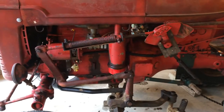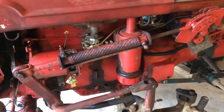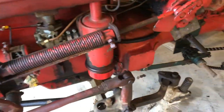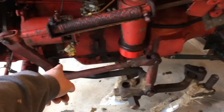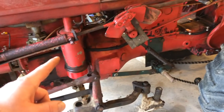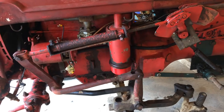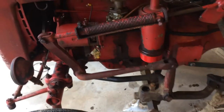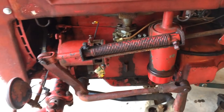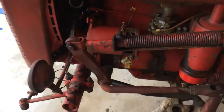If you've run across this video, I would say go check out the Farmall Cub, but on this one I'm essentially doing the same thing. I've already removed the two wires off the generator. I've got some kind of electrical issue going on — I've replaced voltage regulators twice on this thing. I keep diagnosing it as the voltage regulator being bad, but I just cannot believe they keep frying. I'm talking two of them in the last year, so I'm going to switch this thing over to 12 volt.